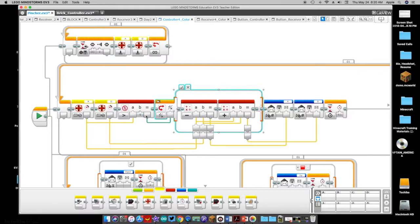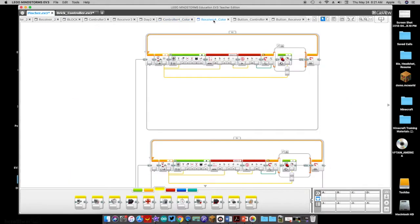As I move the controls forward or backwards, or the other motor to the right or left, it's going to capture those degrees — we're measuring the degrees of that motor position. In this first situation we're looking to see if A is greater than zero, and if that's the case it's going to come over here and check using logic in the switch block. If A is greater than zero it runs these calculations; if it's less than zero it runs the other branch — our true and false are the same calculations but with A and B flip-flopped. This adds A and B (the D motor degrees) together and sends that Bluetooth signal packet to A to control our motors.